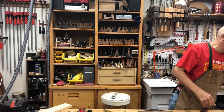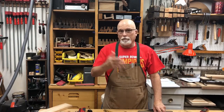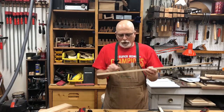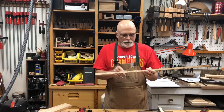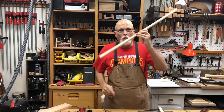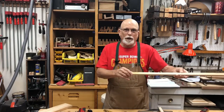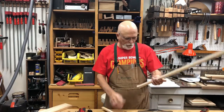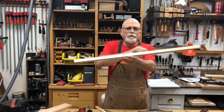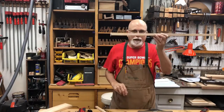One of the best layout tools — if you're going to make a cabinet or multiple cabinets — is just a plain old stick. These are called a story stick. You mark out from one end as your reference: how high the drawers are going to be, where the first drawer starts, the top of that drawer, the bottom of the next. You mark it once on the story stick, then use that as you're building to always mark out where your braces are. I put a washer on the end so I can hook it on the bottom of the project, and you can see marks from the previous project. That way both sides — front and back — are all marked identically the same.